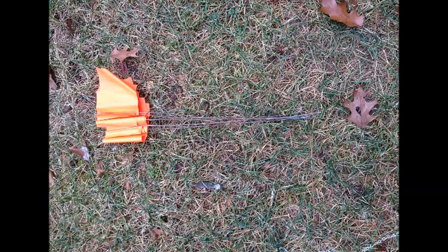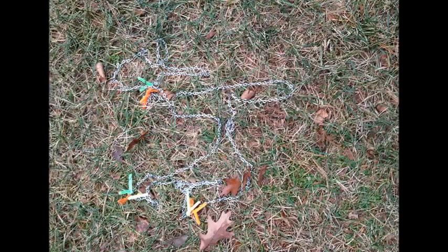Another easily available possibility is shish kebab stakes. Most of all, you'll need to be able to stick them through the links of the chain, which is the next thing you need. Buy a 12-foot length of chain and mark it at the 3-foot point with a twist tie or pipe cleaner. Then measure out another 4 feet and mark it again. Finally, link the ends of the chain together. You now have a circle from which you can form a right triangle with sides that are 3, 4, and 5 feet long — 3 squared plus 4 squared equals 5 squared, that is, 9 plus 16 equals 25. I've also put markers on either side of the main ones in different colors so I can easily see which length is which, something that can otherwise be a pain. Vedic ritualists use rope, but since rope can stretch, a chain is more accurate.